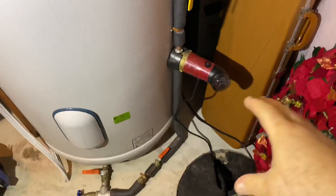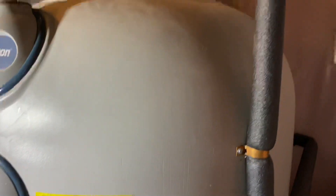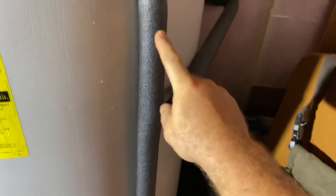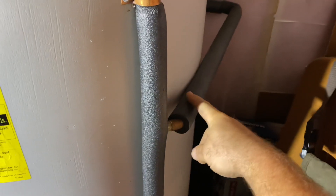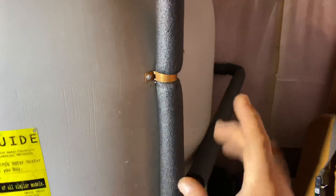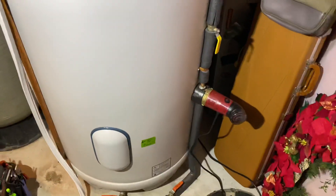What we have here is a hot water recirc problem on an existing installation that's about 18 years old — a big electric water heater, a thermostatic mixing valve, and two branches of a recirc loop: one through the main house and one just through the kitchen, opposite sides of the house. One tiny little pump, no balancing valve, so it's pulling better through one side than the other. We're going to fix that by using a few favorite products.